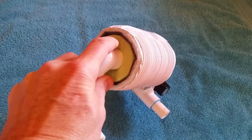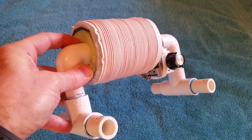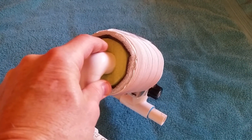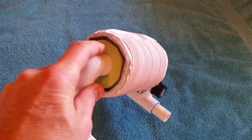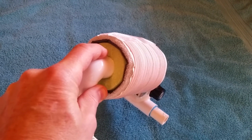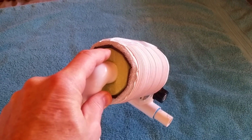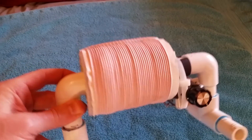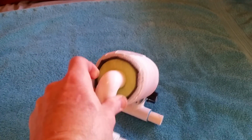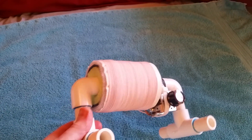This specific model is designed to be airport-friendly — in other words, to quickly and easily pass through TSA security checkpoints at major airports. In order to accomplish this, instead of using a ring of ferrite rods, which might resemble a ring of dynamite to a security agent, it uses very thin, flat, 3mm thick Russian surplus ferrite bars of 100mm length. As you can see from the side appearance, someone looking at this would even doubt that it has any dangerous-looking ferrite at all. There's just a very thin, flat ring of ferrite here.